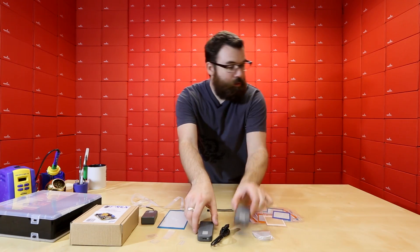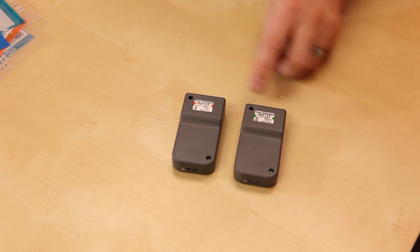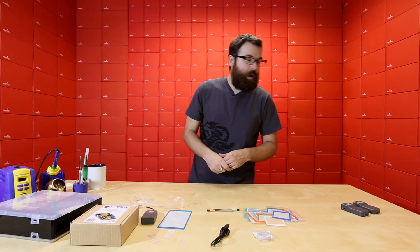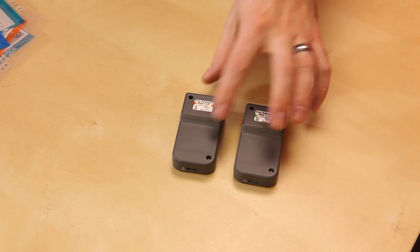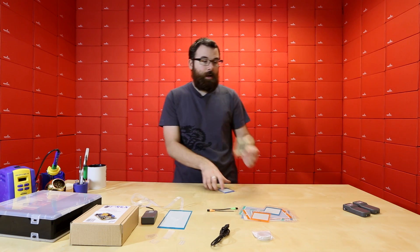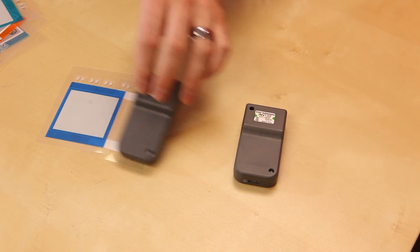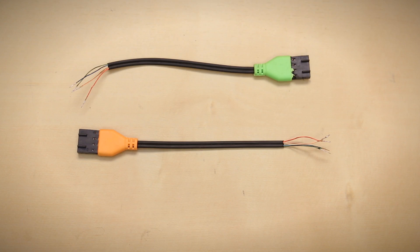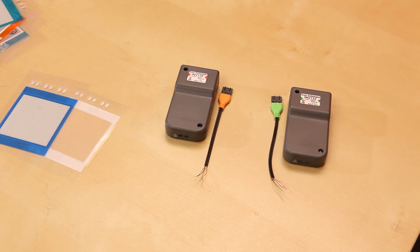All of these panels are driven by two different inverters. On the back of these inverters you will see two different colors — green and red — one is the INV-133 and one is the INV-135. The difference between these is how much square surface area they can illuminate. The smaller inverter, the INV-135, can handle only 8 square inches. So if you had a 2x2 panel and another 2x2 panel, that is 8 square inches, and the INV-135 can drive that. If you have something bigger, check out the INV-133. The inverters also have color-coded connectors, and each connector is mated with a specific inverter and allows you to drive the various panels.